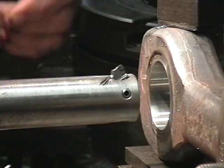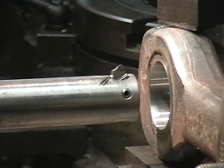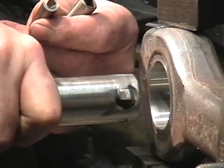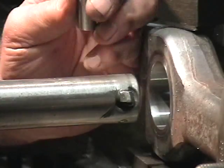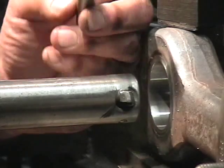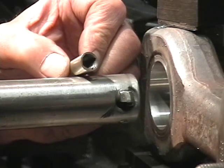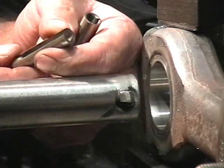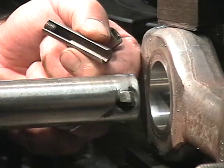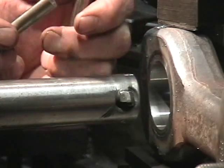These tools are kept using a sleeve and a bar. You just drill right through the center of the bar, bore them, and you can get the solid sleeve — it's threaded in the back and you have an adjusting screw. Or you can get the open type sleeve with an adjusting screw. I don't really have a preference of one over the other.